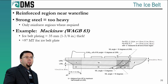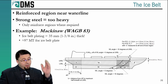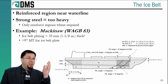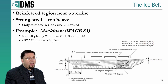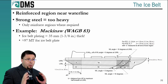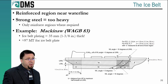On one side you have the structural engineer asking to put more reinforcement in, trying to make an unbreakable hull. On the other side you have the naval architect trying desperately to keep the thing afloat, saying please make the structure as light as possible. It's a careful balance between strength and weight — something we do on every ship, but on icebreakers it gets ratcheted up to a whole new magnitude of difficulty.